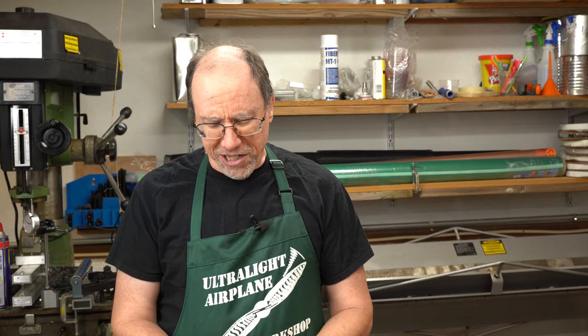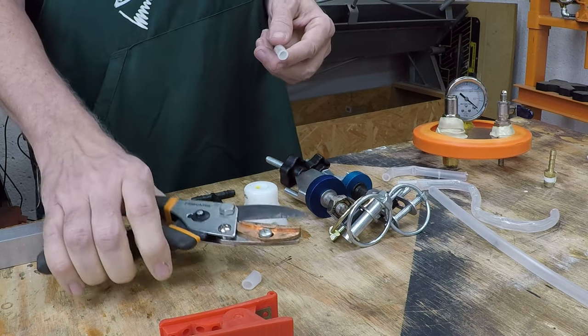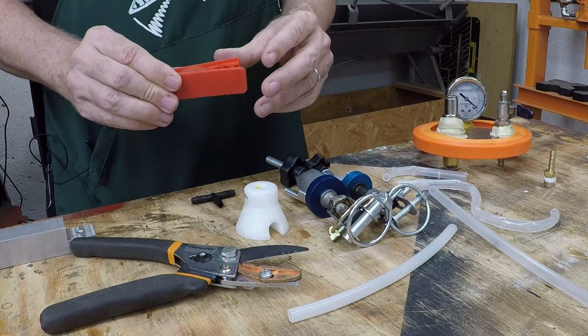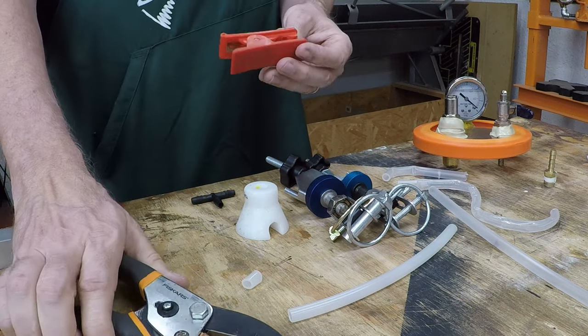These are very nice for cutting off your tubing — works very well, gives you a fairly sharp edge. It does squish it just a little bit, but that's not typically an issue. It's very safe to use, certainly safer than a utility knife. On Amazon you can find a number of very similar ones; some actually use utility knife blades, so you just replace the blade instead of re-sharpening. Since they have quite a bit of cutting force, they will also quite easily cut through tubing that has cured epoxy in it. I did experiment with cheaper cutters, but after playing with them I decided I did not like them — they almost cannot cut through tubing with cured epoxy because they just don't have enough cutting force or leverage.